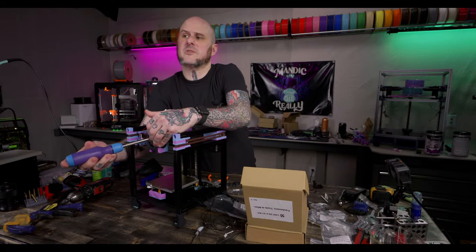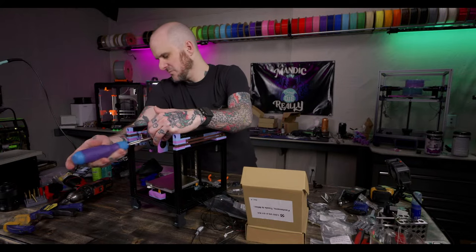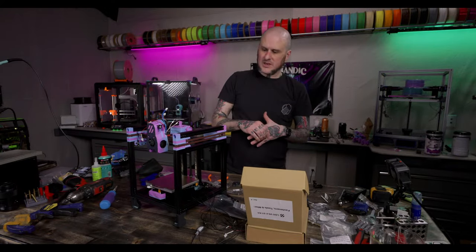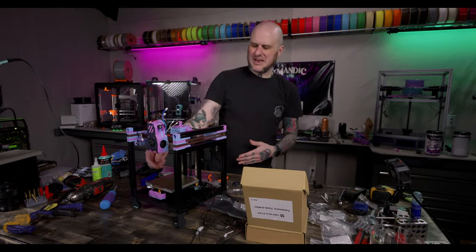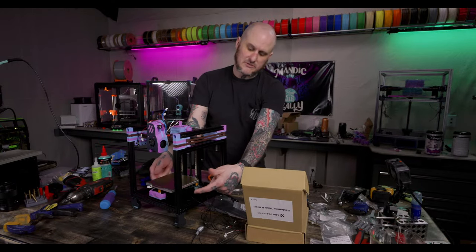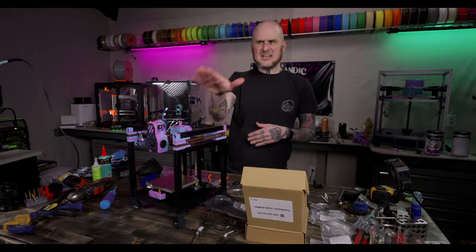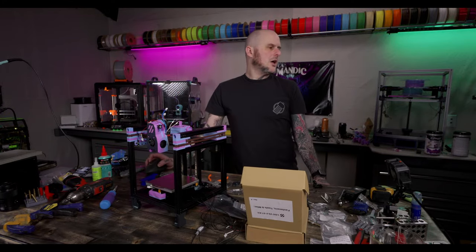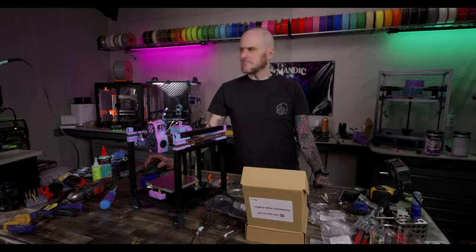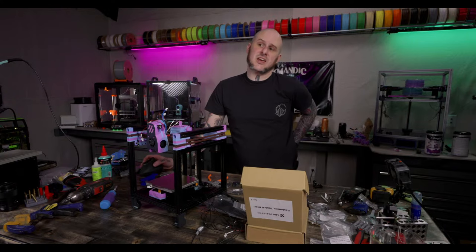Does the V0 suffer from the cantilever design like the Ender 5? It's such a small bed that it's not as big of an issue. It can suffer from that. The default printed parts for the bed definitely have that issue. The Kirigami bed that I have on here, which is a folded sheet metal aluminum design, helps. And then there's a CNC bed to frame that really helps. Where'd you go, Fusion? I think Fusion froze up. It's all angry. Oh, nope, there it is. Not an issue with the Fizex CNC. That thing is rigid AF.